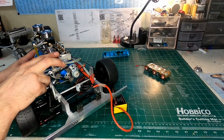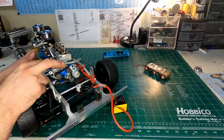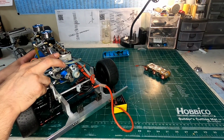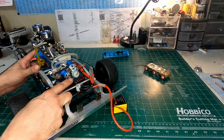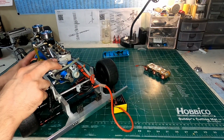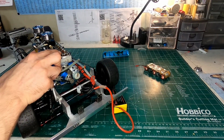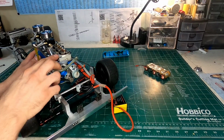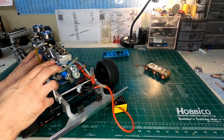So both valves are open at this point, which is called valve overlap. And my exhaust valve is now closed. I'm past top dead center. The exhaust valve is closed, and I'm at full intake. My intake valve is fully open. See, I still have lots of backlash there.